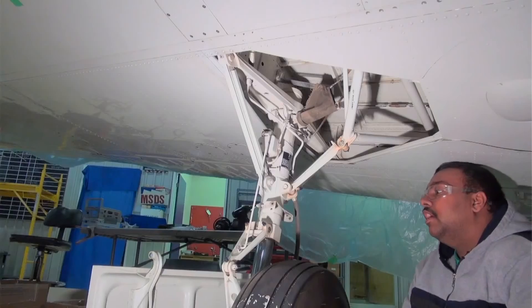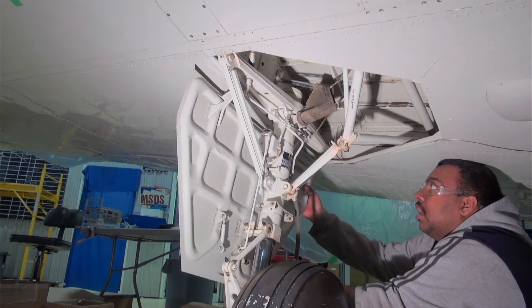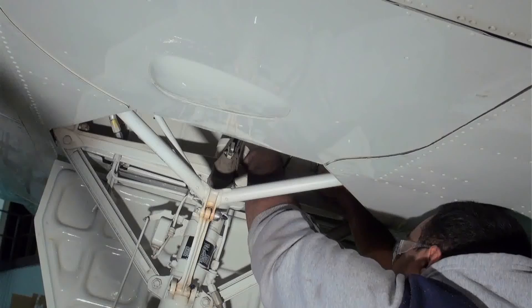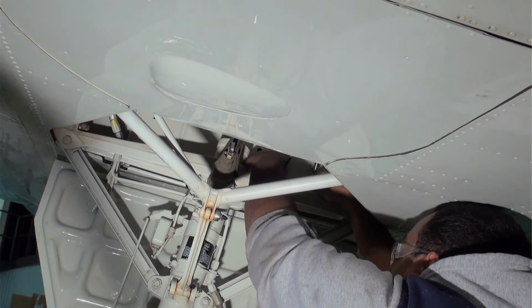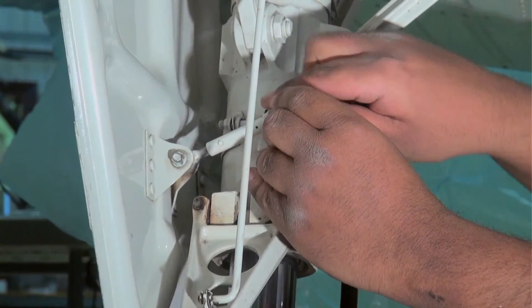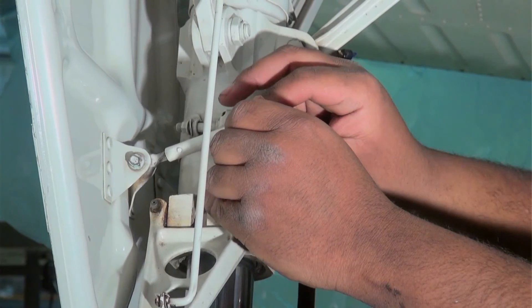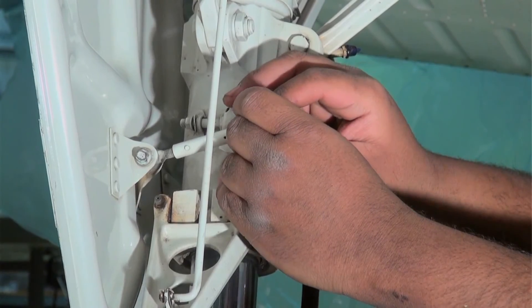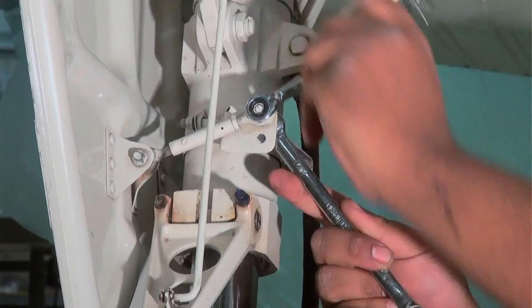The AeroTuff has been pressed into position with equal amounts protruding on each side, and the sleeve fit is checked again for freedom of motion. The stock bushings were flanged, and the flanges are the thickness of thin washers, so with the AeroTuff bushes we will use thin washers for spacing. Once the hinge bolts are tightened the door should move easily. The stainless sleeves will be captured between the steel washers and the aluminum fuselage flanges, and the bush will turn against the sleeve as the doors move. The stays are reattached with washers positioned as they were removed.